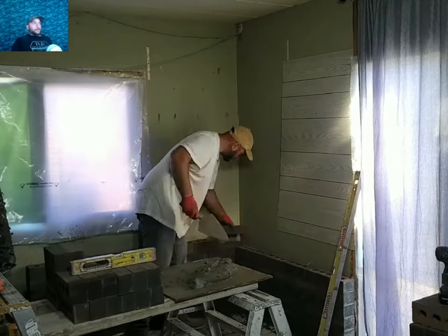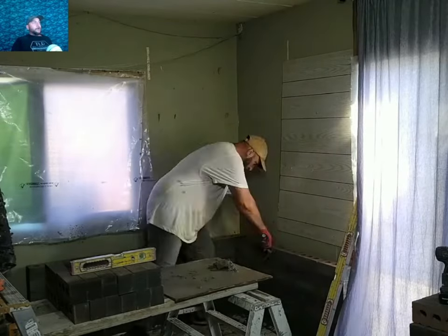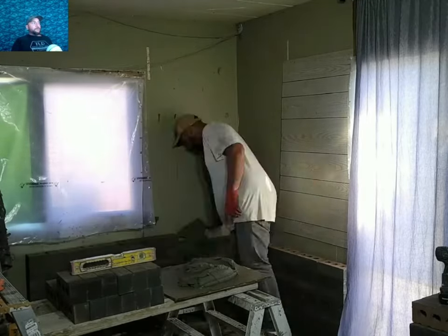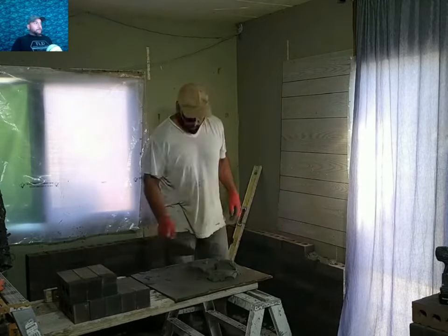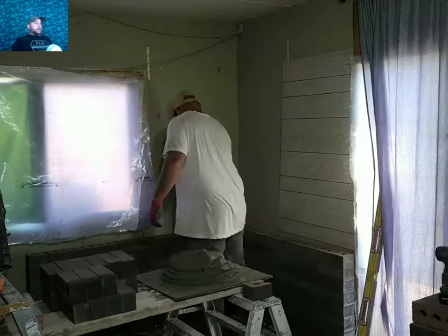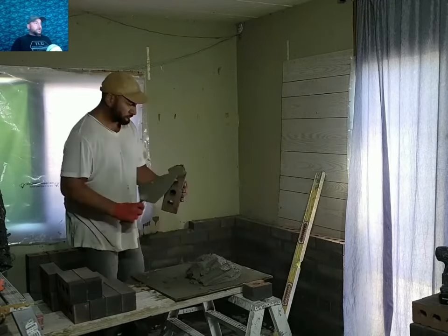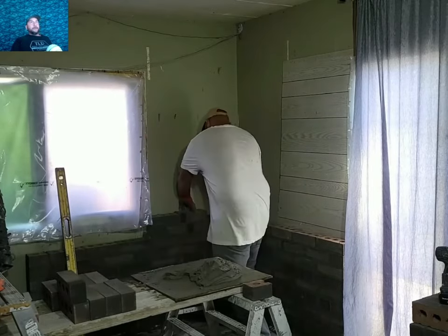I actually have these polys up here all year round — I use them for temperature control, to diffuse light, for privacy, and in winter for added insulation. I also have a layer of vinyl laminate sub-flooring — that spongy styrofoam-type stuff — just trying to get the house as efficient and insulated as possible. The voids in the brick will also act as additional thermal barriers. I've got a few solar panels which aren't super useful in winter, but trying to get as close to off-grid as possible.